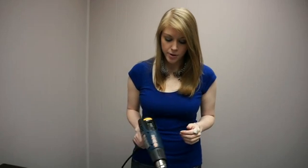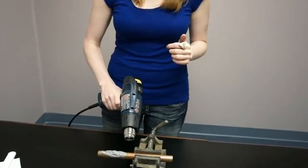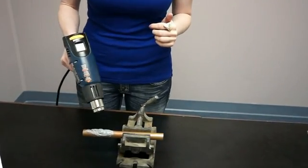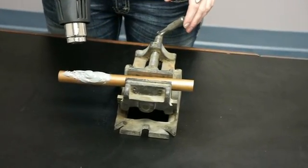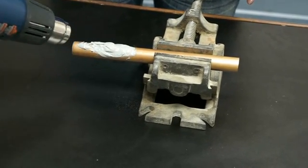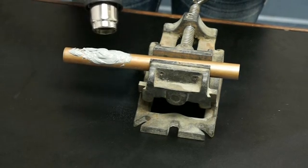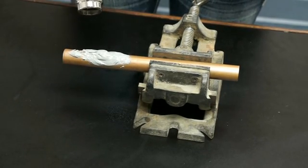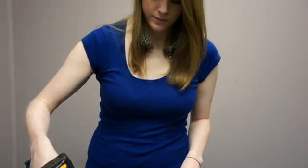Now I'm going to hit it with some heat. I've grabbed a standard heat gun and I'm going to apply heat to the PipeSeal product, making sure I get both ends of the pipe nice and hot, a little bit underneath too. Right now it has somewhat of a glossy finish, and as that heat hits it, it's going to start to dull as it's curing and begins to harden. I'm going to get that pipe nice and hot — and you can see that finish is beginning to dull, losing its gloss.